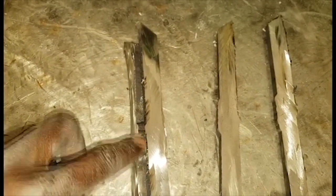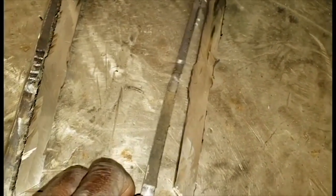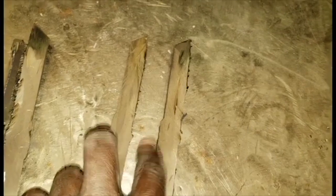What we're going to be doing here is rounding those corners. You want to take away that sharp edge. That's pretty much four straps — that's what the QC is looking for. Those sharp corners I'm pointing at, you're going to round them. You're not going to worry about the cap — that's not important. Pretty much leave that cap intact and leave that root intact, because we're not doing a root bend nor a face bend. We're going to do a side bend. That's the zone they're going to be testing.